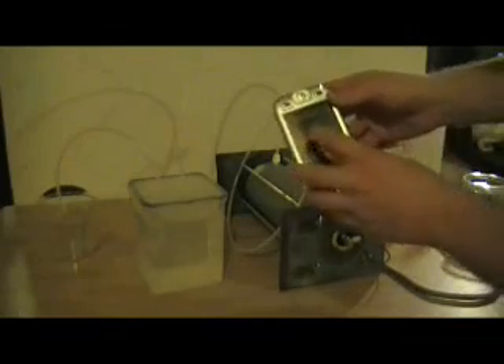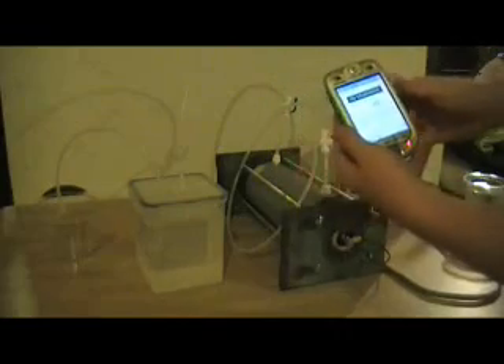The second tube here is just simply for filling and it's turned off. I have a 5-amp variac running into a full wave bridge, with my digital amp clamp meter on the AC side. This is my stopwatch. I'm going to turn it on — it's set to 130 volts. We'll see how much gas this will produce.